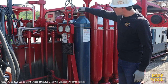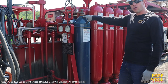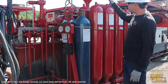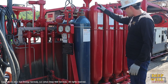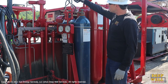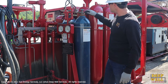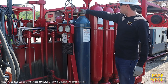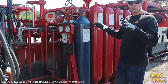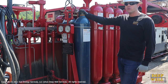These two bottles in the back are what's called the nitrogen backup system. Not all primary accumulators will have these, but all deep well accumulators have them as a safety backup in the event that the pump has failed and the accumulator bottles aren't holding pressure like they should. In that case, we would open up these bottles and the nitrogen gas would get dumped through this silver line right into the operating manifold, and as the gas expands in the hydraulic fluid it provides enough pressure for us to actuate the handles and close the ram we need to close.